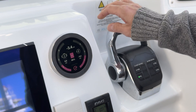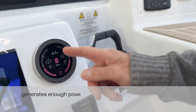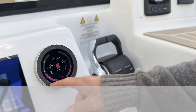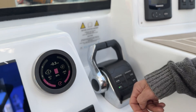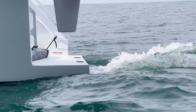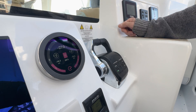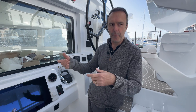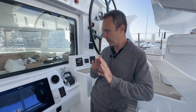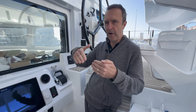We'll go up to just around 1500 RPM, which is what the starboard side is doing. So now the port hull is generating and driving, and the energy it's generating is being delivered across to starboard to drive the starboard. So one engine is driving both hulls and there's virtually no power coming out of the batteries. I've completely turned the engines off — so let's drive on both, totally on electric. There's no engines. When you're driving like this on electric, you're taking power from the battery, and that's making the motor turn. The motor drives through the gearbox and turns the propeller; the engine is completely turned off. The engine ignition is on, and we're using the ignition from the engine system to control how fast the electric motors go.